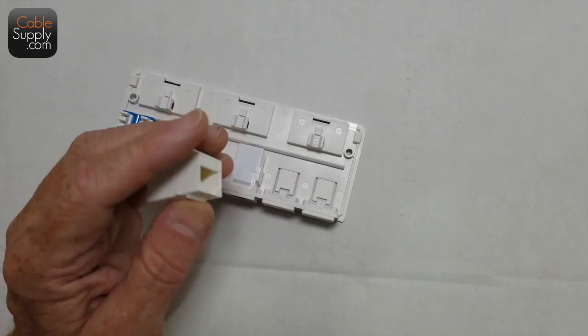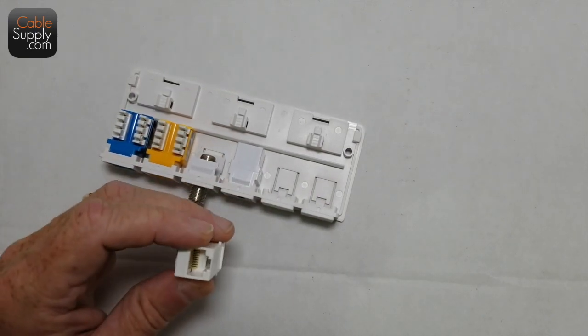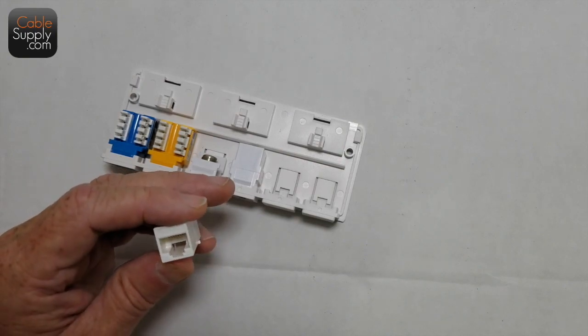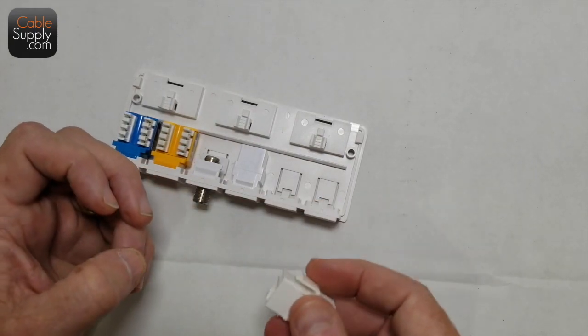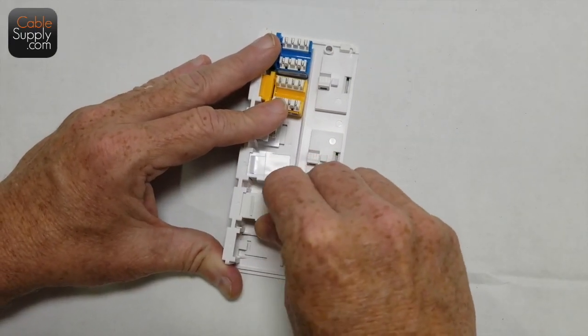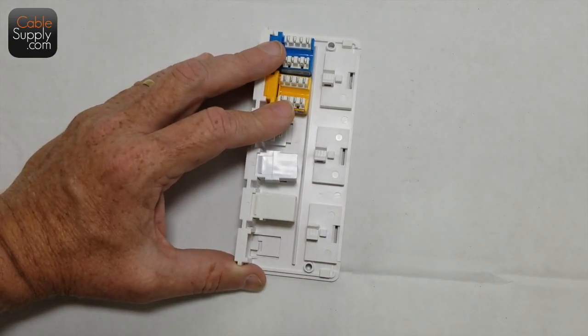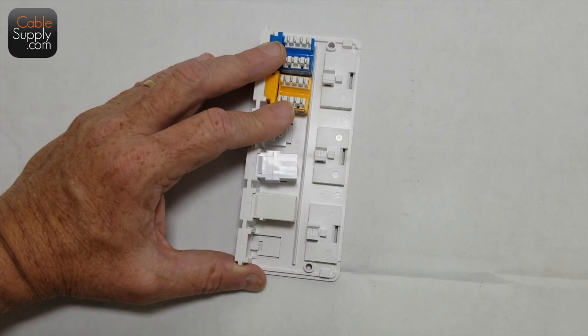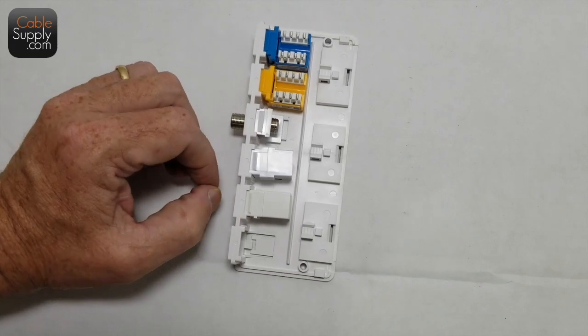Here's a neat device that a lot of people aren't aware of — it's called a pass-through. It's an RJ45 pass-through with Cat 5e on both sides, and you can attach two patch cords to it. Why would you want that? If you use this in this type of setup, you can just use a patch cord — you don't have to do any cabling. For a short run under 100 feet, you could just use a 100-foot patch cord rather than inside wire, which comes in a thousand-foot box of solid copper.